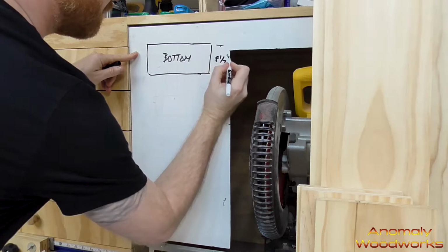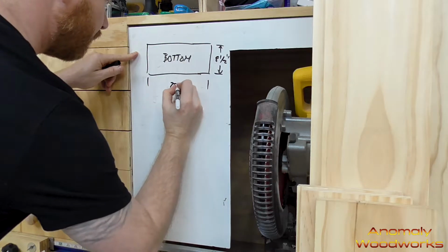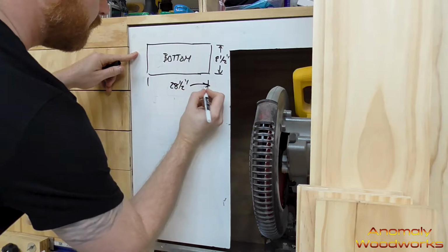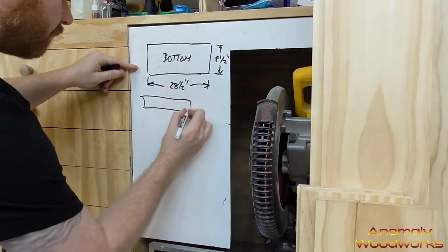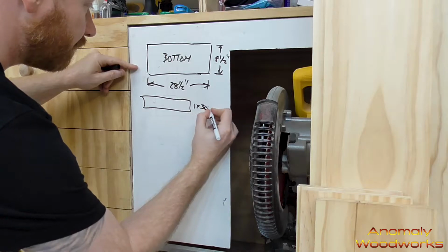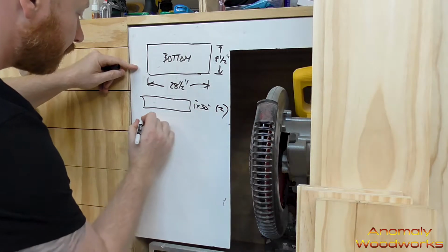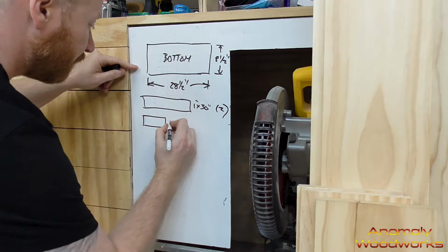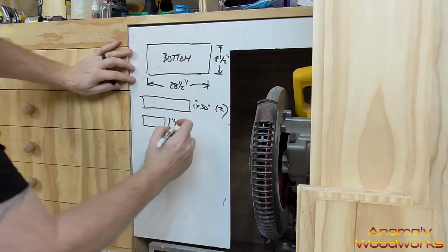Now, I'm going to be making this out of walnut to match the dining table that is already in the dining room, but I just want to say you could probably make this out of select pine, knotty pine, oak, poplar, whatever you can get at your big box stores. I know for the hardwoods that at the big box store you can get pre-milled half-inch thick pieces of wood. You'll see when we get into this that the thickness at the bottom of this tray is only a ½ inch thick and the height of the whole tray is only 1 inch.